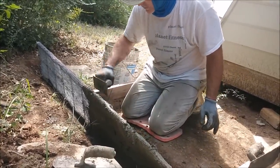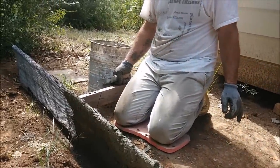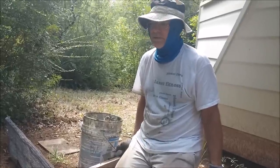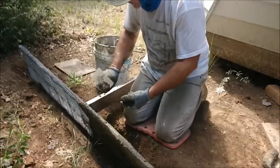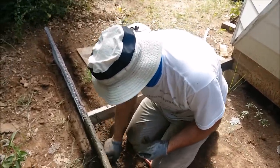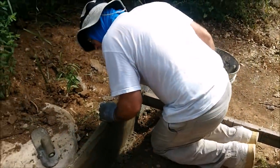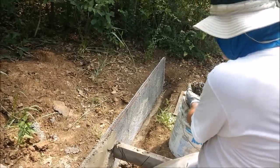On bigger walls I'll put half-inch hardware cloth on one side because it's easy to push concrete through. You want to be sure you get a sand mix — it doesn't have big rocks in it; the big rocks won't push through the little holes. These are kind of flat panels here, which is a disadvantage. If you're building curved things like domes or curved walls out of ferro cement you can get very great strength. If you're really trying to build something flat with ferro cement you're always going to be disappointed — it's not really a good medium for flat things. I'm using a smaller trowel because I'm tired; with a smaller trowel you can get greater force per square inch as you push the concrete through the wire. It'll have coverage on both sides, and once it dries it'll be quite a bit stronger than you'd guess for a one-inch thick piece of concrete. Ferro cement is labor intensive.